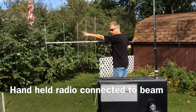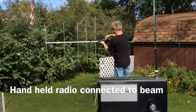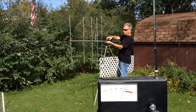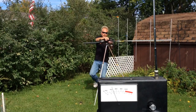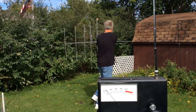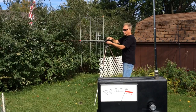The beam is facing that direction right now, and that works for both transmit and receive. So I'll slowly rotate the antenna and you can see what happens by watching the meter. When I transmit on the radio you'll see the signal intensity increase as I point towards the field strength meter antenna. The antenna elements on both of these are vertically polarized right now — running up and down — so that does make a difference. I'll show you that in a second.